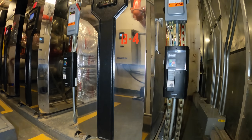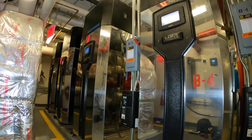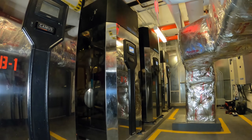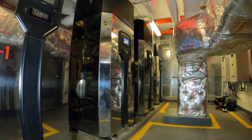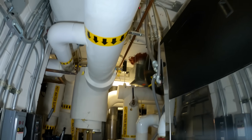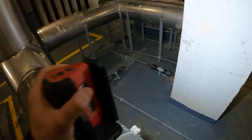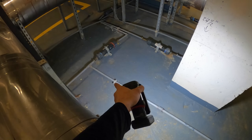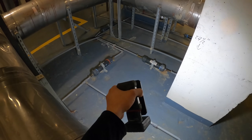Hello everyone and welcome to Jumperman Tech where we specialize in HVAC but do everything DIY. Today we're going to be pulling strainers on these boilers. Christian here is going to be replacing the condensate neutralizer. There are limestone chips that go inside there, so when the system drains it passes through and filters — pretty much so you don't eat away at the drain and contaminate the drain line system.